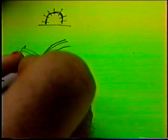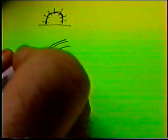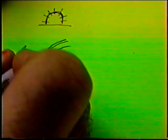Now what I'm going to do, when I take the pin out, I want to take some thick CA and fill this hole. Now, two things I don't want to happen. I don't want to have it drool inside the canopy, so I'm just going to try to seal it, put a little bit of kicker around the area. Easiest way, just the slightest bit of kicker on a Q-tip.